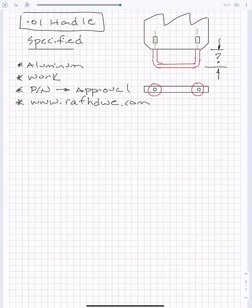As far as the fasteners go, on this particular part, you're going to have a socket head cap screw, appropriately sized, and you're going to have a split lock washer, appropriately sized. So both those part numbers will come from McMaster-Carr. Find the part number. For the socket cap screw, just download the model, save it as the file name, which I talked about in the overview.